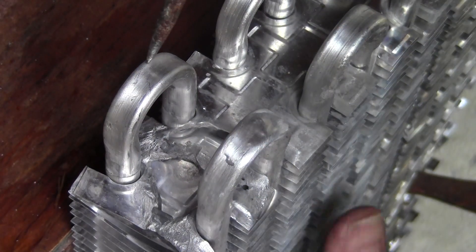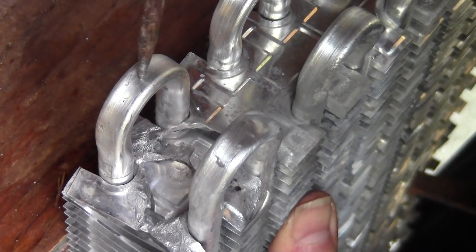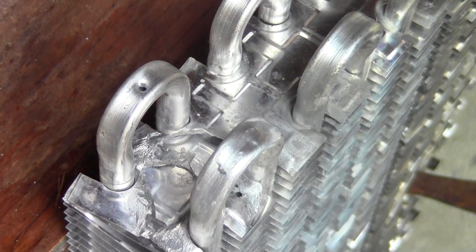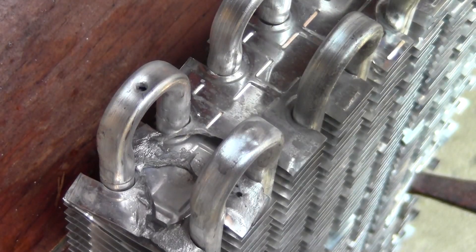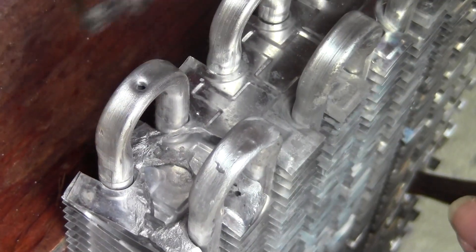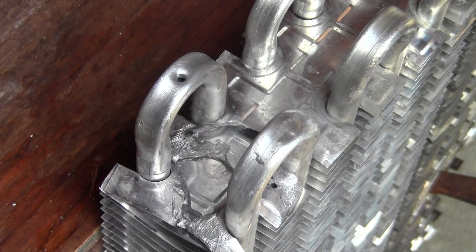Go ahead and turn your heat on. She will use Super Alloy 1 to repair the next hole. Now remember with this one, it's completely opposite. We are using Super Alloy 1 — different rod, different flux — and we're mainly heating the base metal, not the rod.